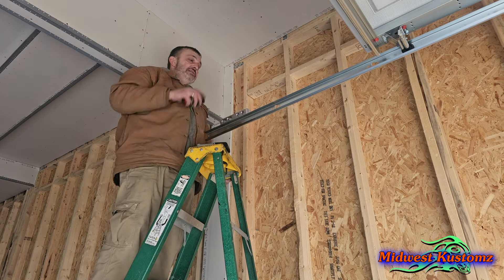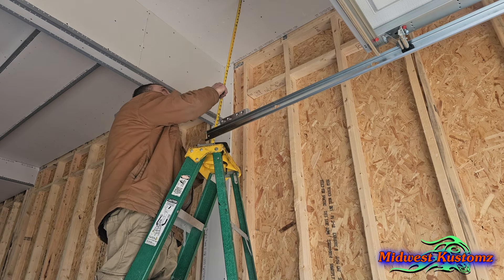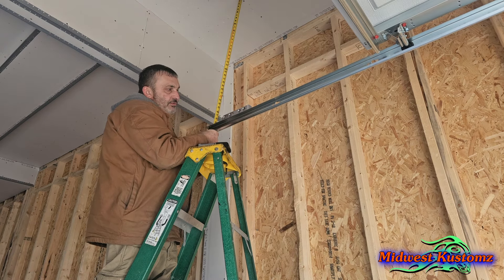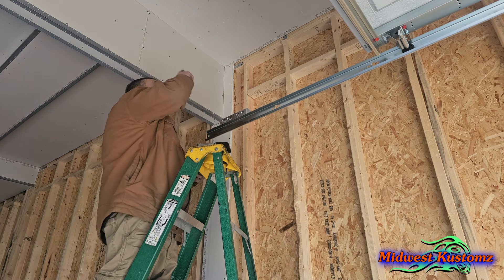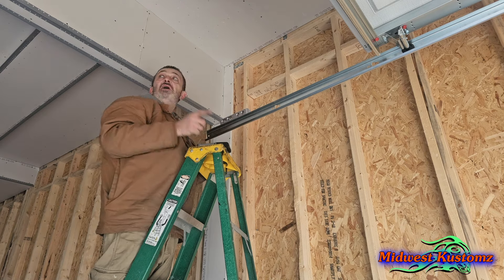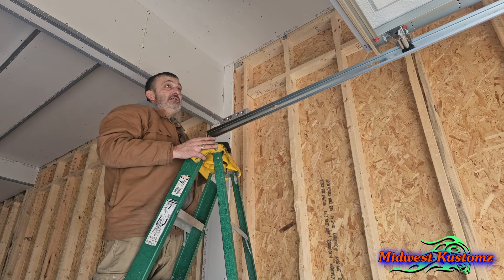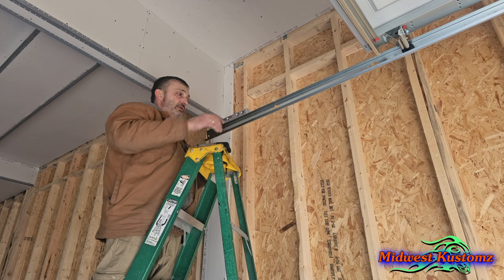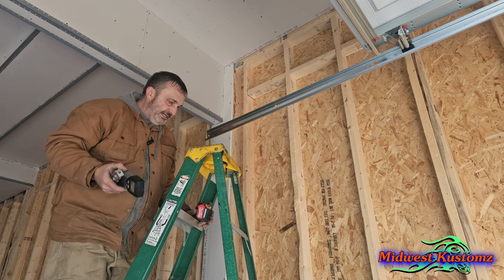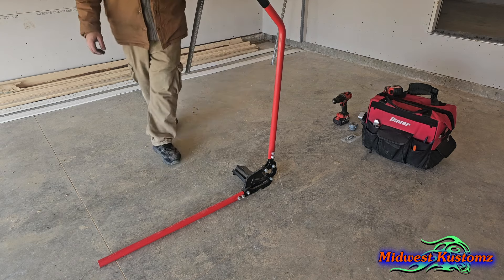Up here I usually go about 18 inches per piece. I take my tape, go up to about where the angle brace is going to be at the same angle it'll hang — that's going to be 41 inches. When that bubble's level that'll be 41 inches, and 18 for the horizontal piece. So 41 cross piece, 18 wall piece. That side has an opening over there but 18 should be fine. So for the angled leg, let's make it about 28 inches. So 41, 28, and 18 — I'll make one set for each side.